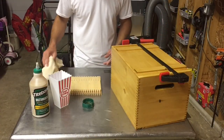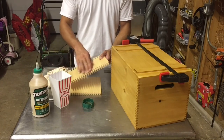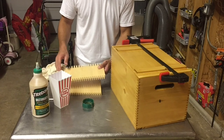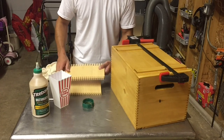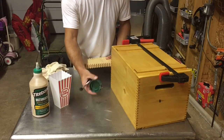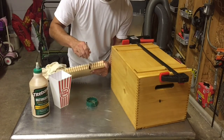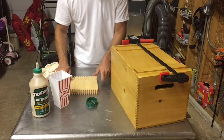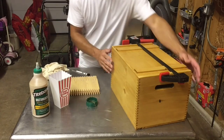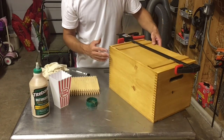For glue-up, I like to use a wet rag and just dampen your wood, but try not to get water in the pins. By wetting your wood first, it makes it easier to wipe off the glue. Another tip is to line up your pins and use a little orange juice container cap filled with glue, and try to pass through two pins at once. Because you have so many pins to do, time is of the essence. Typically I do just one side — I'll do the back first, let that dry overnight, and then come in and do the front.